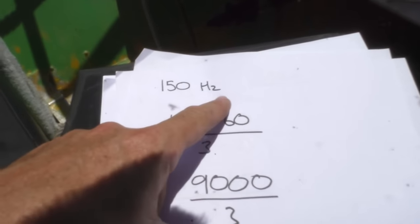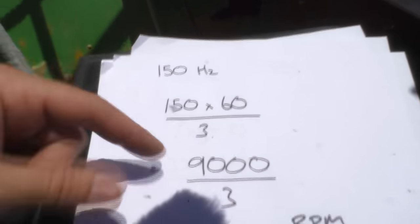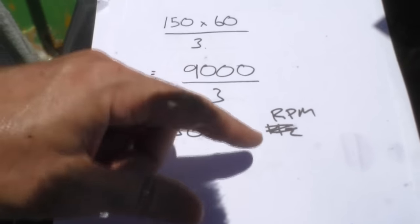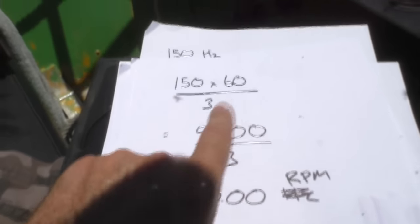Working through the maths: 150 Hz × 60 = 9000 cycles per minute, divided by 3 cycles per rotation = 3000 RPM. So we should be reading 3000 RPM on the tachometer at 150 hertz. Because the reading is off by roughly a factor of two, I think the calibration potentiometer won't have enough range — that's more in the 5-10% range. So I'm going to swap it from six poles to three poles. If you're getting a figure way off what it should be, you've got to suspect the pole selection before any fine calibration.